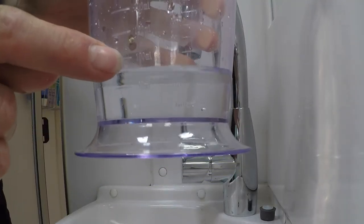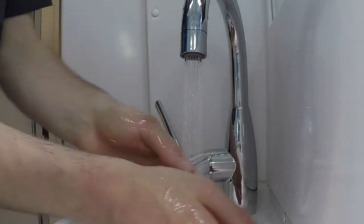The most restrictive aerator delivers only 100 milliliters per five seconds — it's very little, almost impossible to wash your hands. The water is connected and it works, but I'm not sure if we'll leave the 100 milliliter version in place or go with the 250 milliliter version. We'll find out later.